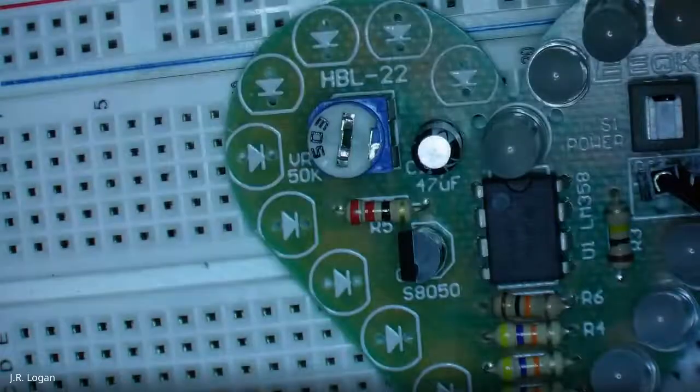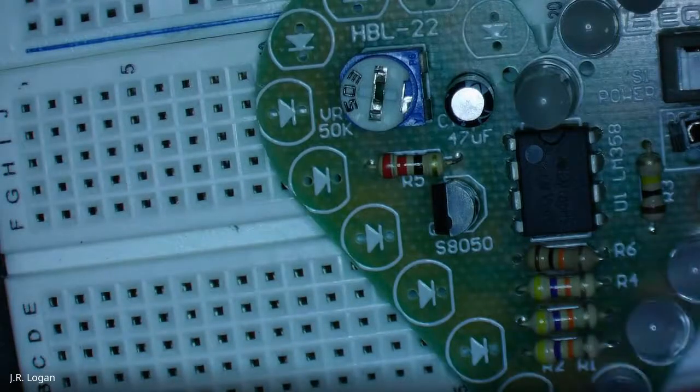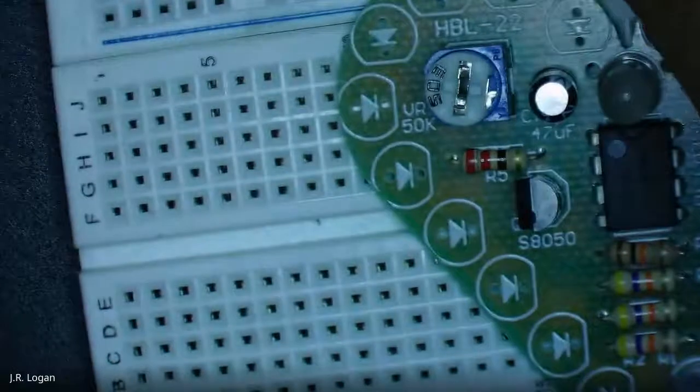What you do then is you heat it to this temperature, which evaporates off the flux, and it brings all of the solder that's in that mix together, and it just solders that component magically in place. To watch it happen feels kind of magical. It's almost like the Terminator, the liquid one that makes shapes. Everything's spread out. You get it to a temperature, and it all just collects around the legs of the component you want to solder. It will sometimes even straighten the component out so it lines up with all the pads, and there you go. So that's how a mass production electronic piece would be made.